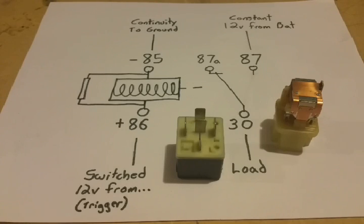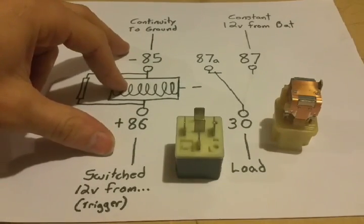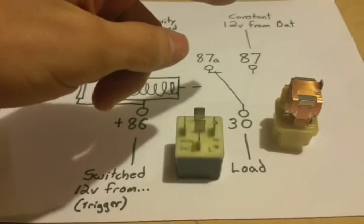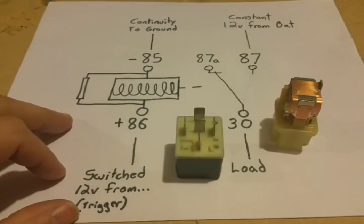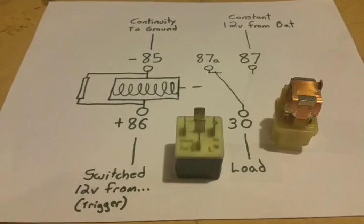That covers four-pin and five-pin relays. Hopefully this video helped answer some questions about how relays work and how to troubleshoot them. For me, understanding these relays really clicked when I understood the two separate portions: one side is just a coil activated by a trigger source, and the other side passes current through to your load. Once I was able to break it down that way, it helped me understand these things really aren't that complicated, and there's actually a lot of cool stuff you can do with them. Be sure to leave a comment, let me know what you think, like, subscribe, and check out some of the other videos.